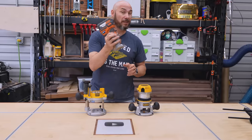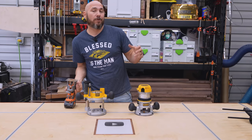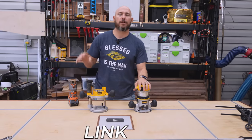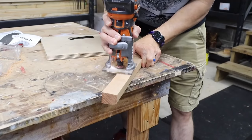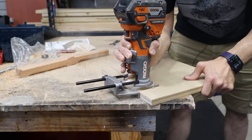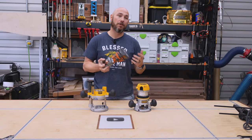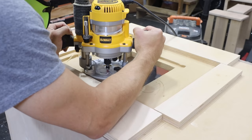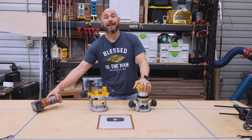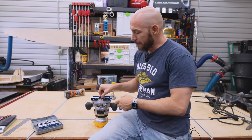I made a video comparing this cordless router to a corded router of about equal strength, and I was pretty surprised by the outcome — link in the description and at the end of this video. This trim router is okay for edge profiles, but every time I tried to cut dados with it I kept having to restart — it's just not made for that. You can't do things like that easily, which is why the plunge router is such a versatile tool that every woodworker should have in the shop. This should be your first router, not the trim router. If you're looking for a couple of things to make your woodworking life easier, I highly recommend these setup blocks.